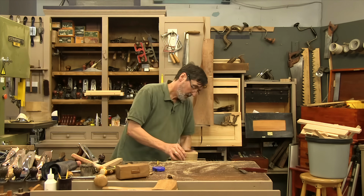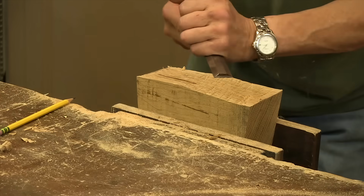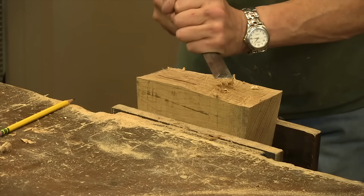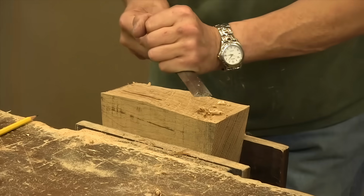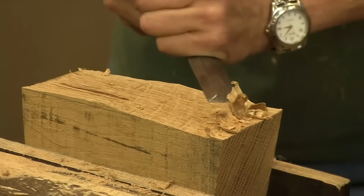I might take this with a wide chisel, sharp, and I might go in here, go across with the corner of your chisel. Watch this. This is a technique, this. You'll love it. You go across here, and you use a quarter of the chisel width, and you chisel across this like this. Watch this now. See, it's so easy.